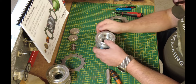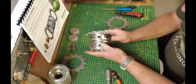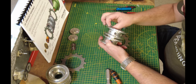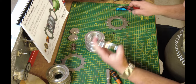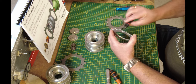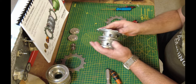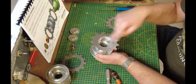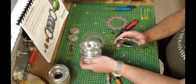Just before we carry on, I wanted to bring to your attention something of note. These sprocket teeth fit reasonably well over the hub, but when you look through here I can see there's a gap. I think it's because there's an ever so slight change — it's not a hundred percent — and because this is a sharp corner, all I'm doing is using this deburring tool just to take that sharp corner off. Now that fits on there perfectly — it's so tight. You do need to make sure that teeth ring is really tight on the sprocket, otherwise it just sits off of it.